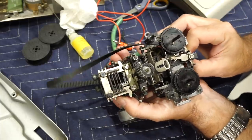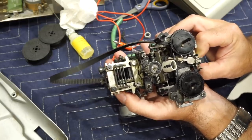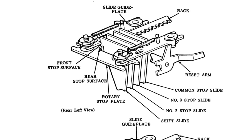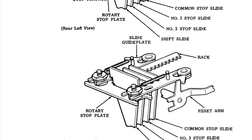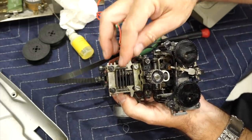For example, if I push on the two bits, I can go all the way through. But if I release bit 2, I only go through the two first plates, as the third plate is down, stopping the rack. Bit 1 controls the first shift plate and is harder to demonstrate. That plate does not have any holes — instead it has shoulders, and allows the whole rack assembly to move half a position forward when it is up. This is used to select odd or even rows, effectively doubling the number of attainable positions to 8.